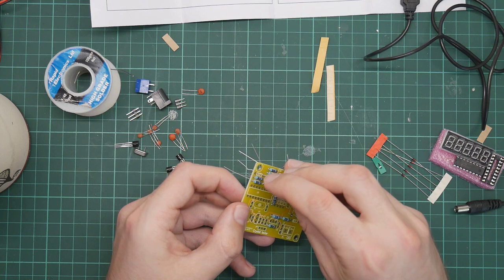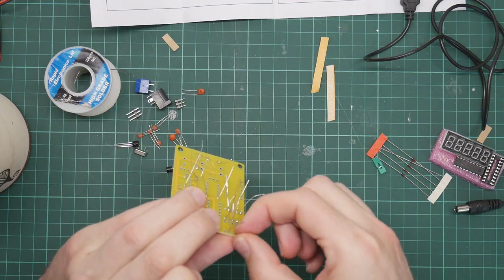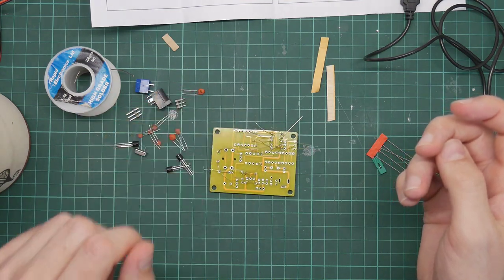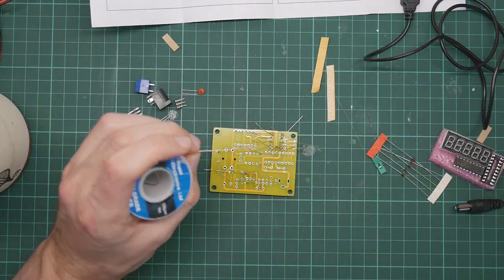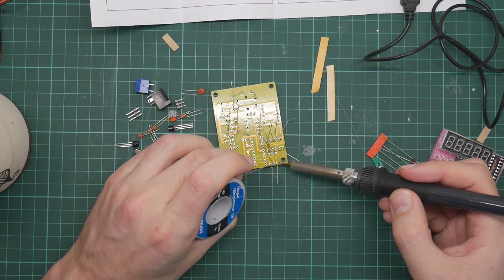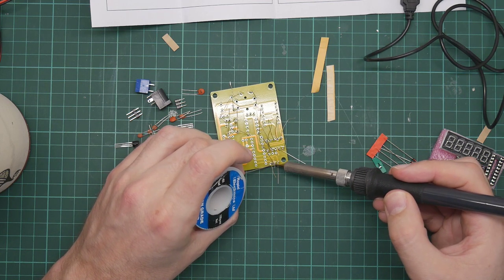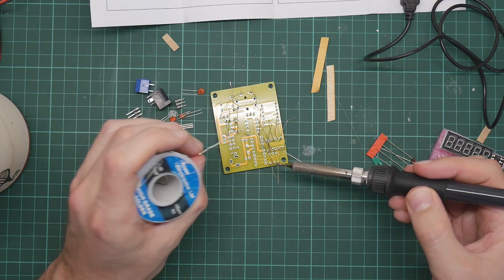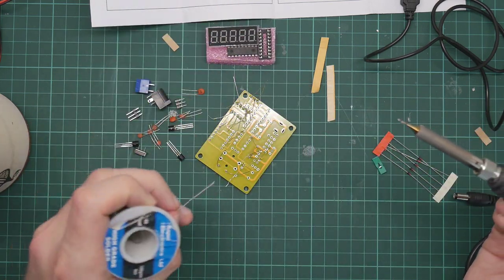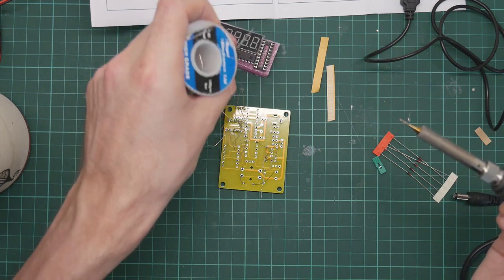You notice that there are fewer resistors than there are segments. LEDs are not ohmic devices, which means the current through them does not vary in proportion to the resistance. So you have to have a resistor in series with an LED to keep the current under control. Otherwise, you blow the LED. And you may notice that there are 8 resistors, but the 7-segment display has a lot more than 8 LEDs in it, because each digit is made out of 8 LEDs, 7 for the digit itself and 1 for the dot.